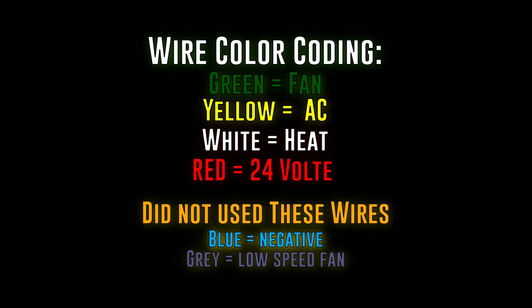I wanted to pause and make a quick disclaimer: I'm not an AC guy, don't claim to be, and do this at your own risk. I got this information from other YouTube channels and reading several AC forums. After studying a while it became clear how it worked. The thermostat is just a switch. This unit runs on batteries which power the internal switching. So if you set your AC to come on at 72 and the temperature goes to 73, all it does is connect the red wire to the yellow wire, and the green wire for the fan — making that internal connection and providing that 24 volts to cause the unit to switch on.